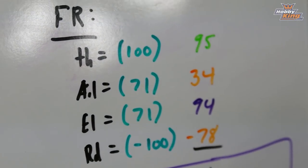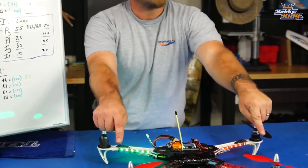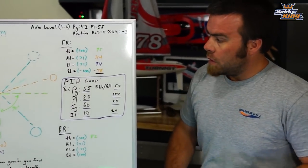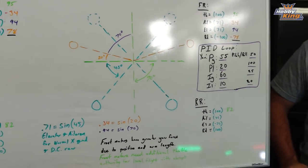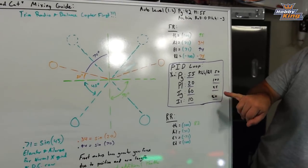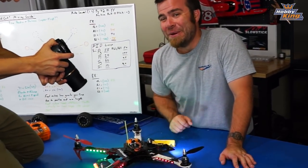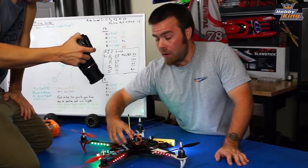There's one more step: because these front motors are at a different position, they have different leverage than the rear motors, so it affects the way it turns and flies straight up — that's why you get that pitch effect. The other two things we need to tune are the yaw numbers and the throttle numbers, which I arrived at more or less by trial and error by flying straight up and seeing what we can do. This is a bit advanced for where I intended to go with episode two of the KK series, and I will come back to basics — but for now, the advanced stuff.